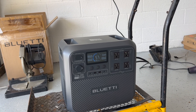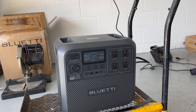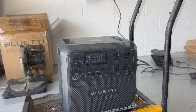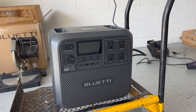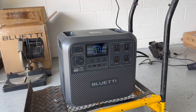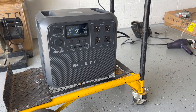This is the first testing with the app. It's quite a lot of power and energy capacity for such a small unit — 2600 watts and 2073 watt-hours is quite a package for this size. It's not complicated, so there's not much more to say. We'll test the ports shortly — but watch, it should gain one more percent in the next 10-20 seconds. There it is — again about exactly one minute for one percent added.